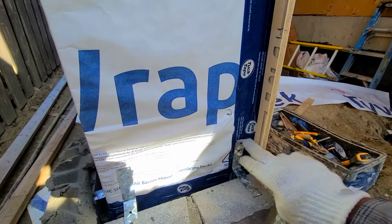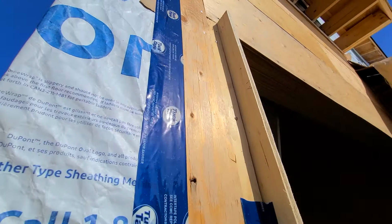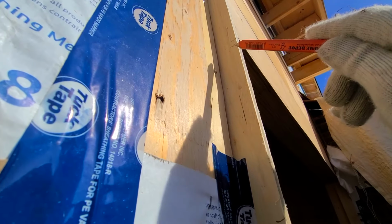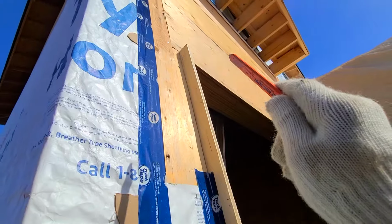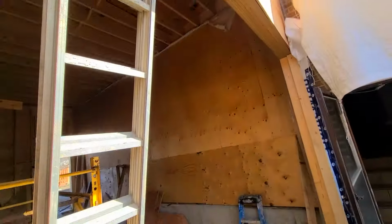And here I put this bad boy on the wall, so that way I can buck my stone right into it. Another thing I did here, I measure from the top, come right down. I measure 10 inches. The biggest size stone I have is 10 inches, and I measure 10, another 10 plus a half an inch, and I did the same thing, come right down to the bottom, so that way I can work up to reach right up there without having to do a cut to go across my garage door.